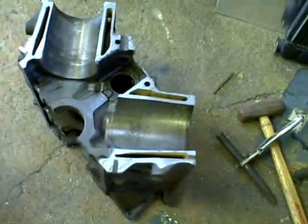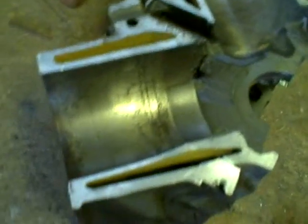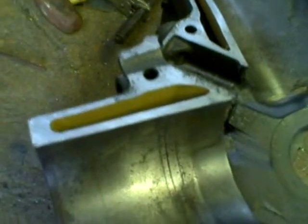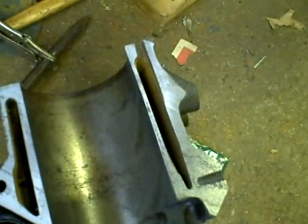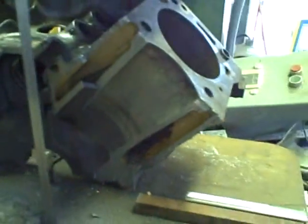There are the bottom halves. What a crappy video this is going to be. That's a little block there — you can see how it's pretty close, pretty thin. About 3/32nds over here towards the top, and the other side looks like a quarter inch. It tapers down to about 5/16ths by the water jacket. Same thing for the other side, and I believe this block was bored 60 over.